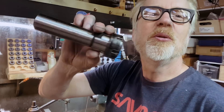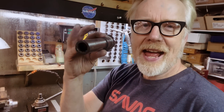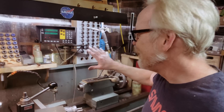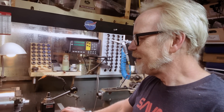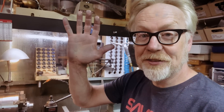This is the ER-32 collet holder. They make them in other form factors — I bought one with a hex body and it was not round. It didn't spin on center, like, by 30 thousandths — something fully crazy. Anyway, the point is I've got all my collets up and running here, and already the lathe feels more useful to me, and I love that feeling. Thank you guys for joining me for this quick shop infrastructure one day build, and I will see you next time.